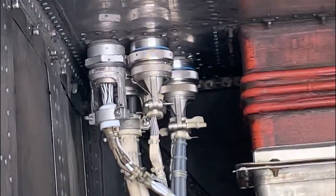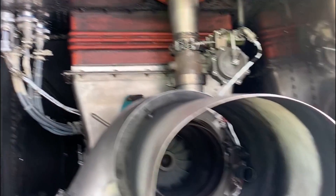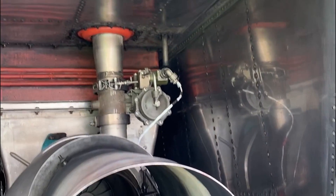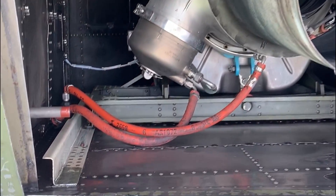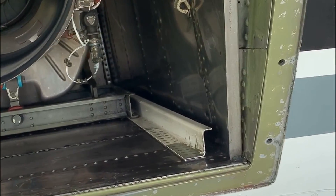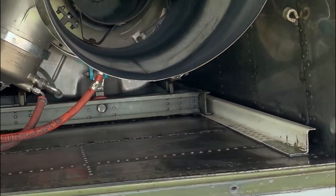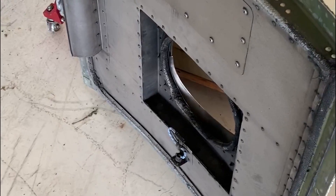Your connections up in there have got to come off: inlet duct, exhaust pipe, a couple of bleed air lines. Then you loosen the pallet, disconnect the fuel lines, the electrical for the ignition, loosen the pallet, and she slides right out.